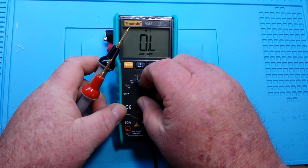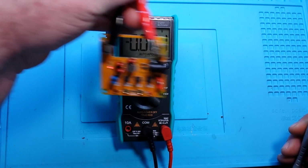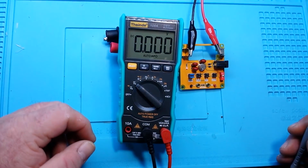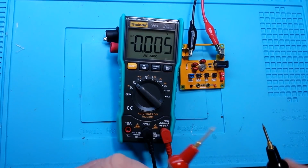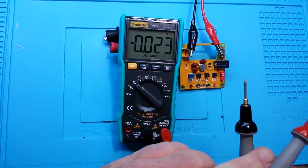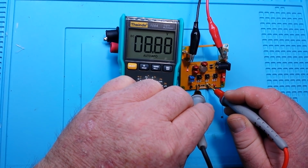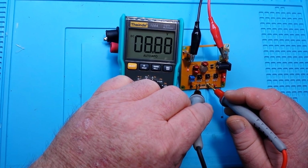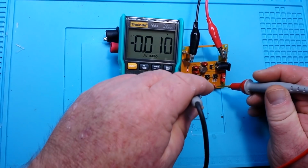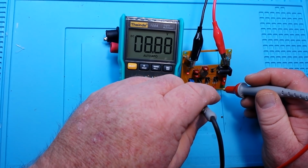All right, next we will test voltage. We're going to go with DC voltage, and for that we'll use our little voltage standard here, which has been warming up for about, I don't know, 10-15 minutes, which should be good enough for government work. Let's start with 10 volts. And let's put the probes in the right holes. Always been a problem of mine. Okay. That I'm not happy about. .88 volts.